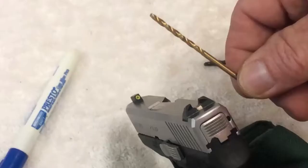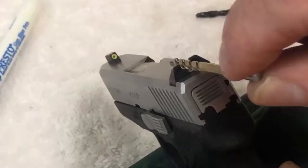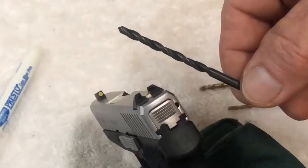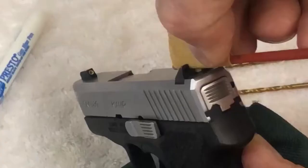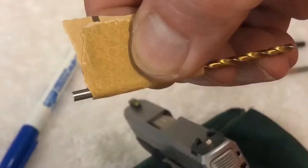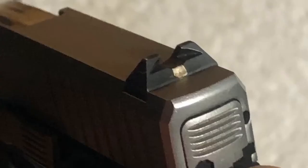Make sure not to go too deeply into the sight on your first pass, as you'll probably need to go up at least one more bit size, leave enough material to form a perfect U, and make sure that the very bottom of your U-notch is centered. If satisfied with your progress, continue forming your U-notch with the larger size bit, minding your angle and depth, using the even vertical plane of the front and rear sight as a gauge. If preferring an even larger U-notch, move to a larger bit. Be careful not to go too low with the U-notch, as going too deeply will affect your point of aim and point of impact. Once the U-notch is to your liking, take something round like the handle of a small paintbrush or the back of the drill bit, wrap a piece of mildly abrasive sandpaper around it, and work in the notch to clean up any burrs and smooth out any marks. If metal sights, apply a bluing agent or flat black paint to protect the metal. At this point you'll have a U-notch that appears to have been a part of the original sighting system.